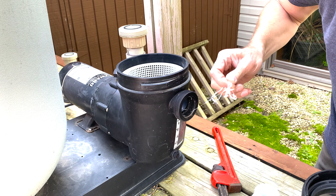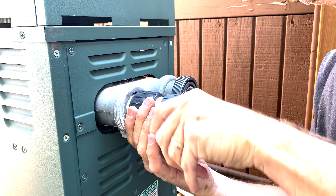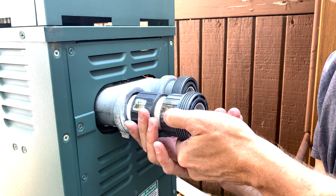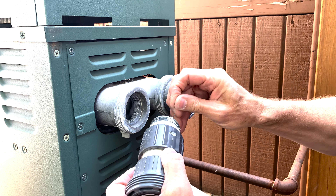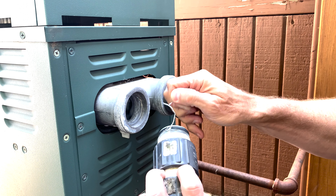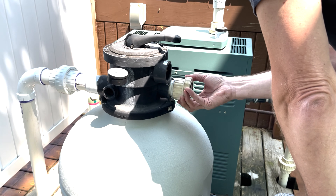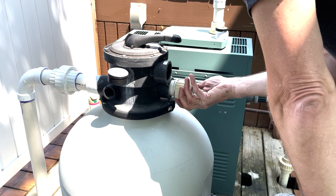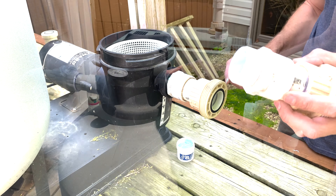The first thing you're going to want to do when getting your pool pump, filter, and heater ready to apply LOX8 is to remove your pipes and any residue or gunk that may be in your pipes from previous thread sealants. In this case there is a lot of ripped up old thread seal tape that did not do the job previously. A lot of thread seal pastes can harden in the threads and any movement within your pipes can end up breaking the seal.